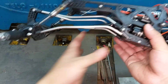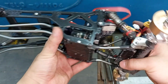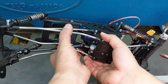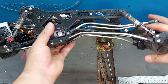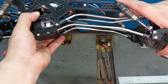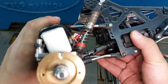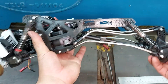We've built all the links — the rear lower link and all four front links. This is a 2.2 shafty build with AR60 axles, a bit long in the wheelbase — technically not legal for sportsmen class since it has a dig and the wheelbase is 13 inch instead of 12.5, but it's more of a fun rock crawler. I'm getting really good clearance from that rear link and I'll be swapping to an extended output in the back soon.